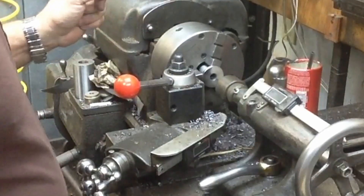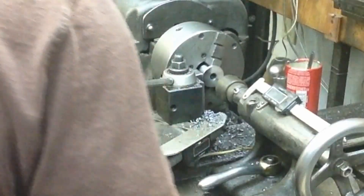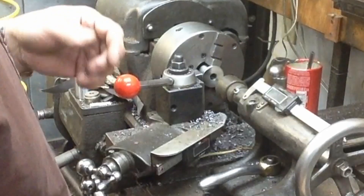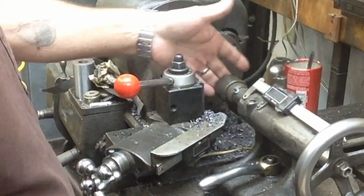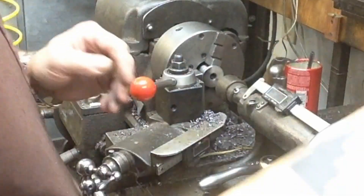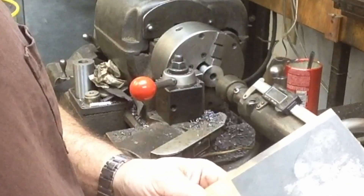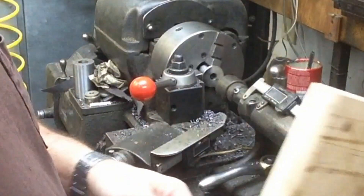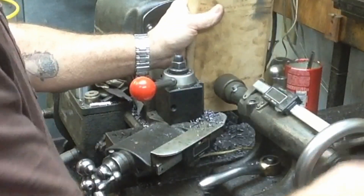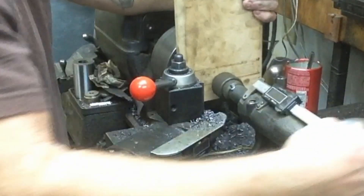What I've done is I've gone ahead and turned the front nose and shank and got them separated for this tool holder. And the way we're polishing off the faces is I just put — that's a quick change tool holder in the tail stock — but I've got a piece of 320 sandpaper aerosol-glued, Super 77 glued, to a piece of MDF. And all you do is you set them in between, run it at high speed and polish your faces.